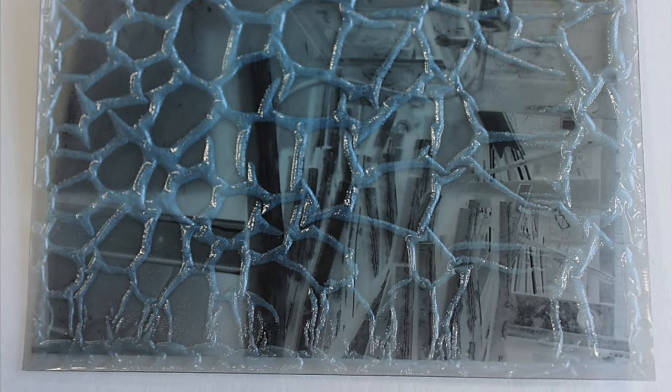The original Model A was made out of a material called Kodak Tenite, which was a type of cellulose acetate plastic derived from wood pulp. Although this was very cheap to manufacture and easy to injection mold, it suffered from a number of shortcomings: mainly it tended to distort and warp over time. It also, if improperly stored, decomposed giving off a very strong vinegar odor, and being based on cellulose was prone to developing surface mold.